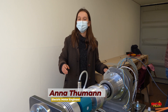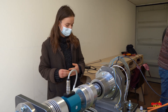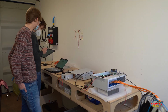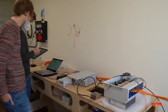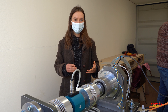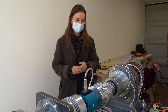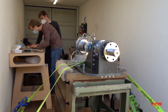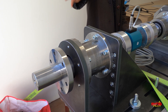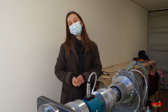Right now we are here at the experimental setup for our self-developed drivetrain at Eastlink. We've just started with the testing phase, verifying our inverter using this smaller motor which we got to borrow from E&A, our partner who's developing our big motor that we will then build into the airplane. Here you can see our testing stand, and later a propeller will be attached so that we can verify the entire electrical powertrain.